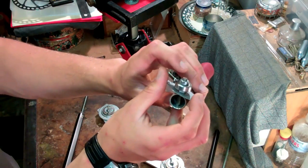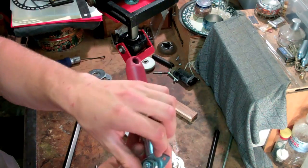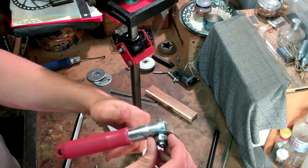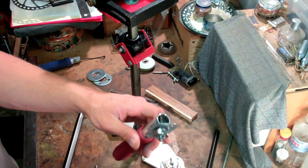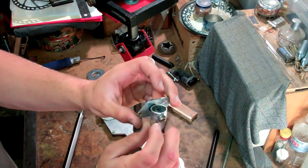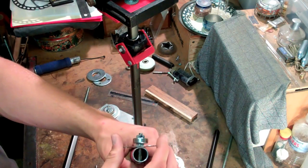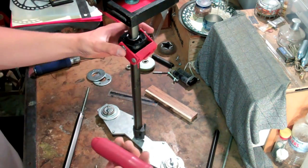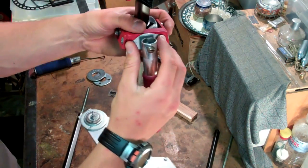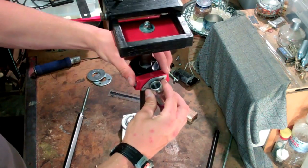Attach the bolt with a nut on the bottom to secure it, then place one of the 7/8-inch bearings on top and fasten it down with another nut — that gives you the smooth rotational motion. Before doing all that, cut out a small piece of plastic or metal that goes around the nut to hold the bearing down so it doesn't fall out. Put that on, slide your bolt through, attach your bearing, and it fits perfectly into the hole. Then screw it down with screws on both sides, and that gives you the good smooth sideways motion.